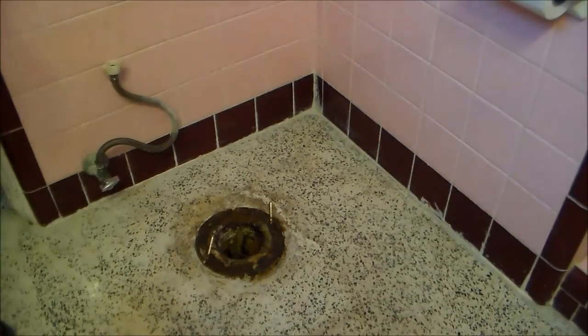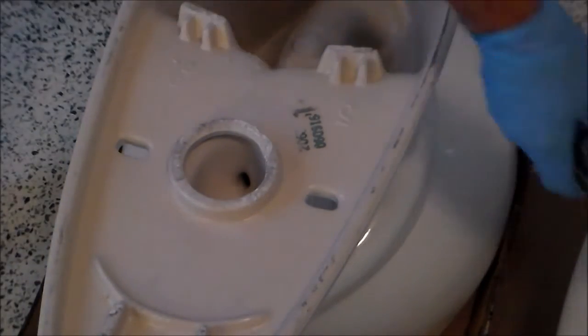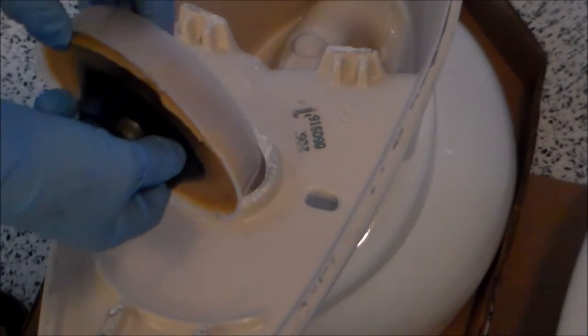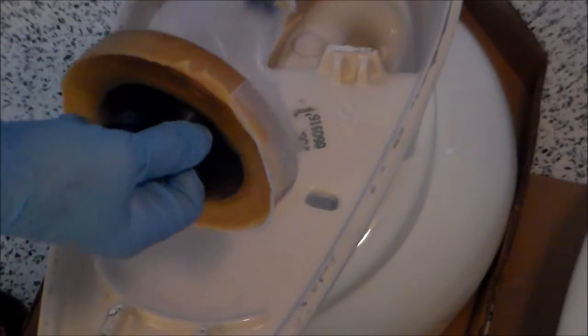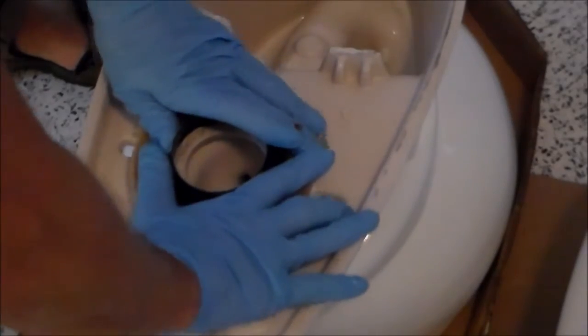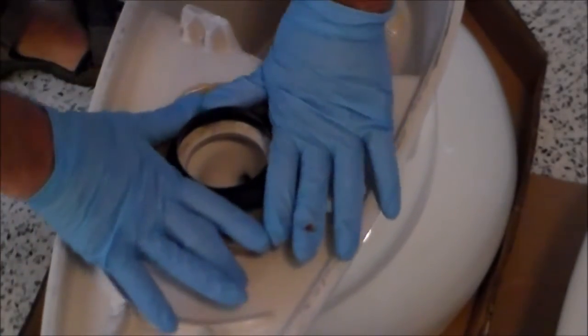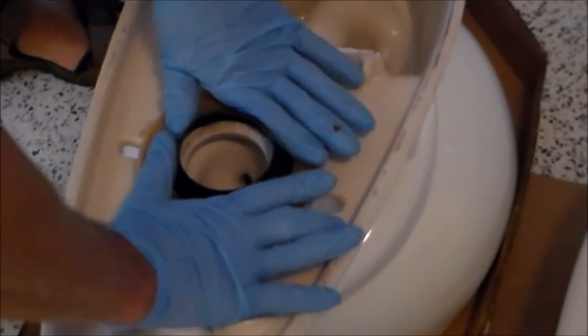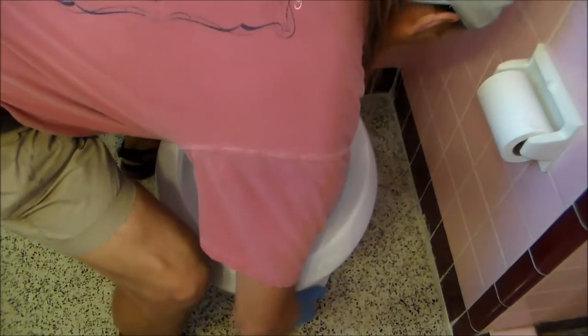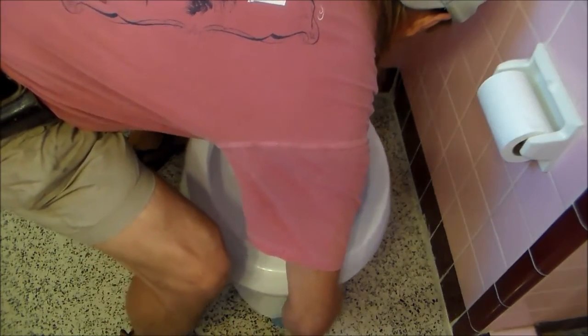And at this point is where you would change the bolts. Now we have to prep the new commode. This is where a lot of people make their mistake — you have to attach your wax ring onto the commode. Some people put the wax ring in the floor, and that doesn't make the proper seal. So remove the protective plastic, and this secures onto the porcelain. I'm not trying to squeeze too much, I'm trying to make it stick. I placed new bolts in the floor — I got rid of those others because I saw some indication of some rust forming.